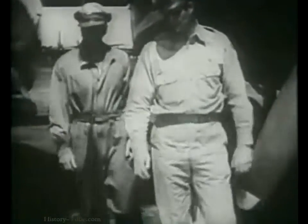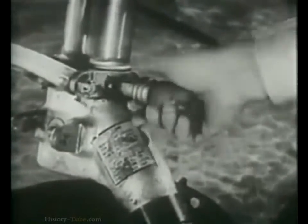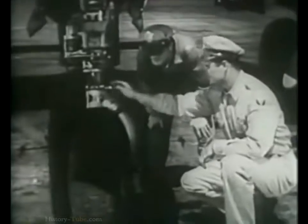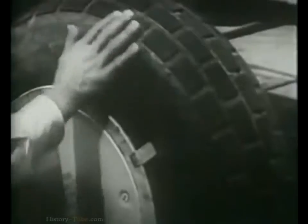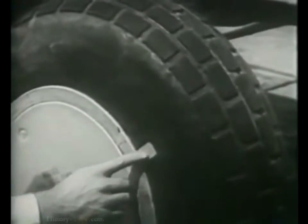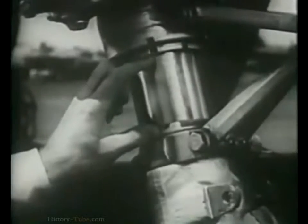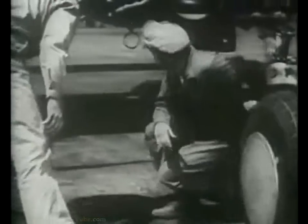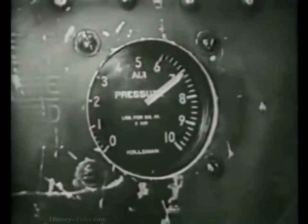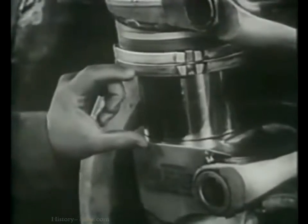Like most airplanes equipped with tricycle landing gear, the P-61 has a nose gear towing pin. Check it, as the nose wheel may shimmy on takeoff and become damaged. Check the nose wheel pin cap — be sure it's on tight. Then check the rest of the landing gear for tire inflation and general condition. The red mark shows whether the tire has slipped on the rim. The strut ought to be extended about 4 inches. Don't forget the pressure in the emergency landing gear system — there's a gauge in each wheel well, showing 700 PSI for the nose gear and 750 PSI for the main landing gear.